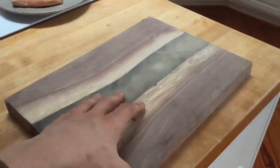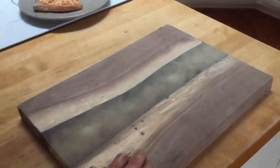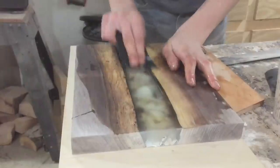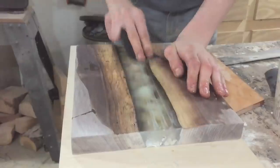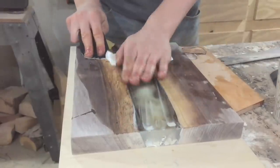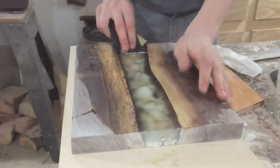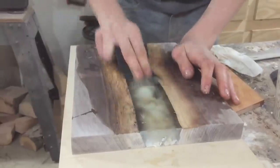That's a very good thing. Now all we have to do is trim the ends and sides and we can really start to polish this resin and get it to a very nice glossy shine. Everything's sanded up to 220 grit. Now we're going to use 500 grit and 1000 grit paper and wet sand that epoxy. I'm just making sure to keep the wood very wet — you don't want there to be any friction or heat. I'm also making sure to wipe off all that muddy, cloudy liquid because rubbing that back in will just create more scratches, defeating the entire purpose.